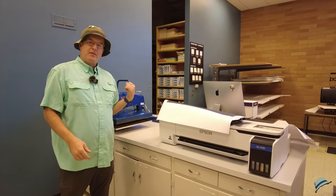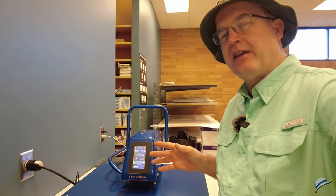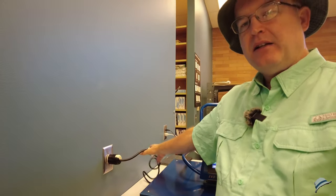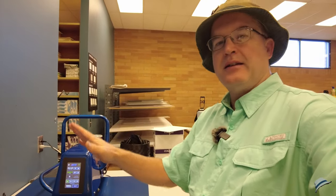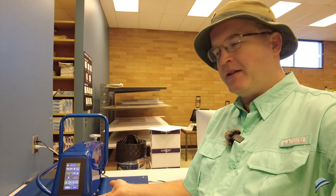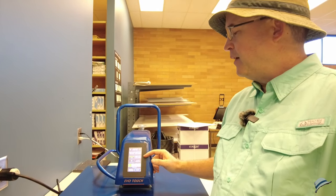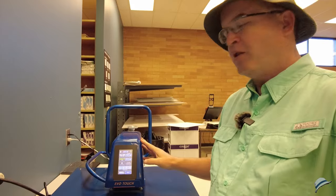That's ready to go, but I seem to have some power issues on the heat press, so I still need to figure those out — we'll be right back. I've got the device back and running. I checked everything, got my multimeter out, checked the cord and socket — I had made a pigtail to accommodate the cord. No circuit breakers had tripped. There's a little circuit breaker right under here that had popped, so I reset that and everything is back to normal. We're at 395 degrees, which is hot enough. We're at about a minute 15, so we'll go a minute 20.